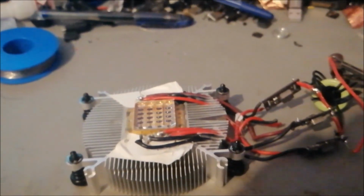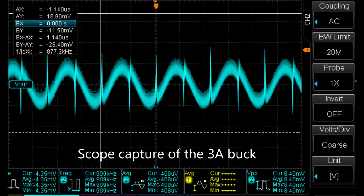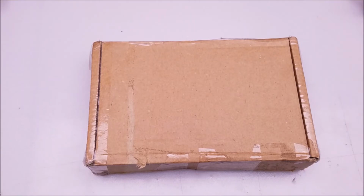Okay, and 3, 2, 1. Nope, array works fine. So as you see, despite the freak accident with my setup, it certainly looks like the Genesis laser drivers can handle 16 volts without a problem and work properly. So I might need some noise suppression as far as inductance feedback.